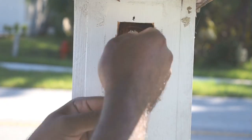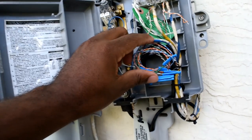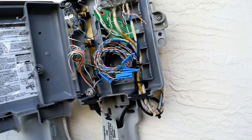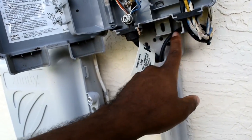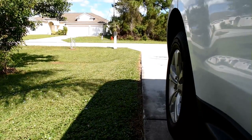If you're wondering how I got a cable to the mailbox — luckily I have a category cable coming from the house to an AT&T box, which I spliced a direct burial cat cable to, and trenched that along the edge of the house and along the edge of the driveway all the way to the mailbox.